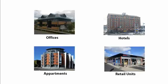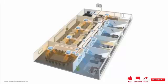The reason they're becoming more popular is because they are very energy efficient, meaning lower operating costs, and they provide very good thermal control. Since some units can provide both heating and cooling, they save precious space within a building — you might not need an additional boiler or chiller, and they take up a lot less room compared to multiple split units. They are however quite expensive to install because of all the controls equipment and pipe work, so although the initial installation cost is fairly high, the actual operating cost is going to be much lower.